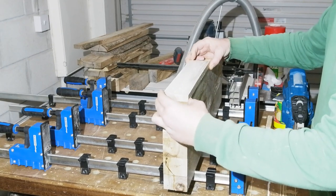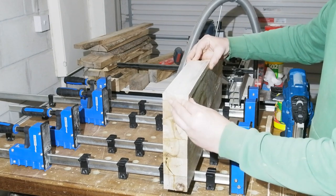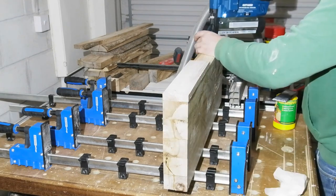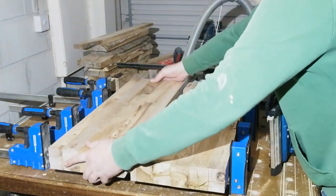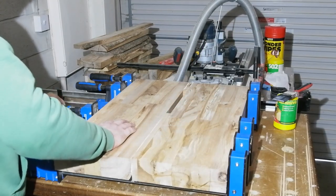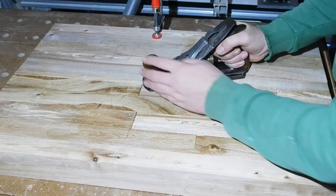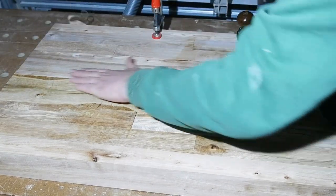I've slightly oversized the strips in terms of depth so they'll stick proud a little from above and below the top — I'll plane flush later. I put a couple of 32 mil 18-gauge pins in each piece to stop them going walkabout as I clamp. Make sure everything's sat nice on the rests and squeeze. I'm not going mad with the pressure, just enough to get a bit of squeeze out. Over-tightening these sorts of glue-ups can send things out of shape. Next day I can plane the center strips flush.